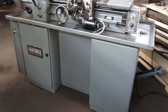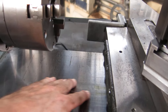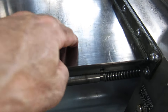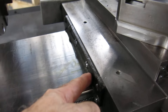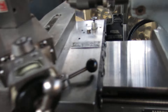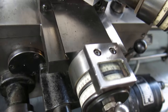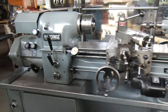Overall it seems to be a good condition machine. I don't really see any significant issues — aside from a little discoloration, I don't feel any wear, I don't feel any grooves or anything on the ways. It's just a handful of discoloration marks from leaving the way wipers in position. We'll probably change the way wipers — they're there but they're starting to show they're tired. The inch-metric dials are in good shape. Overall it's a decent machine.